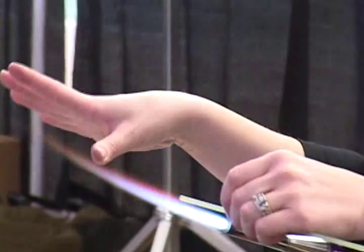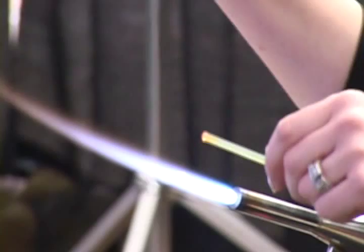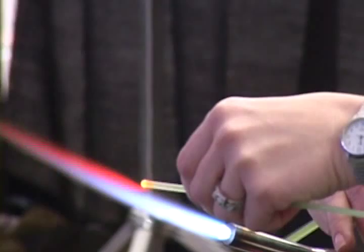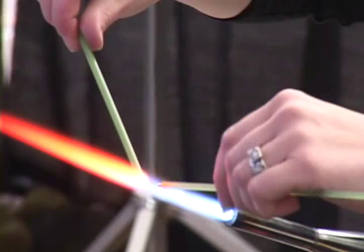So I'd make the frame, put the frame together, and then anneal that, and then I'd start putting the parts on it, and then anneal it, and then check everything, because there'll be cracks that happen from putting stress in the glass, and then I'll repair them and re-anneal it. So the work gets, those parts will all be re-annealed. So if I'm off on that, I don't think it'll be tragic.